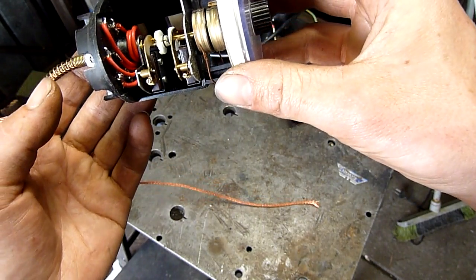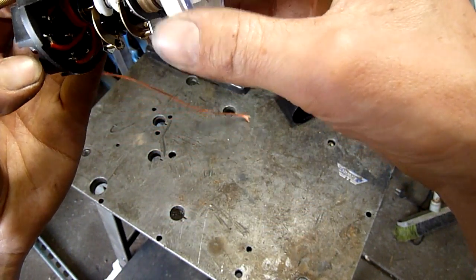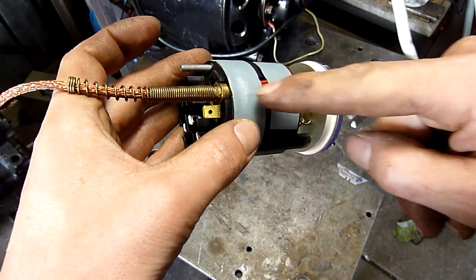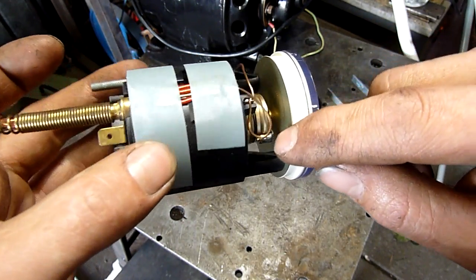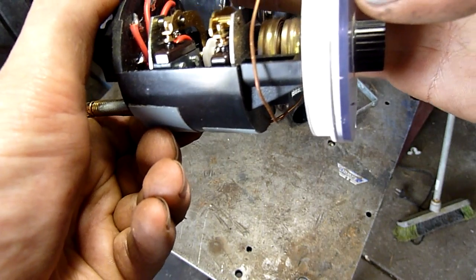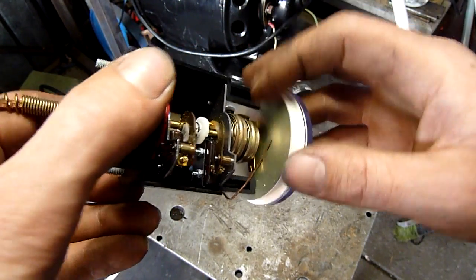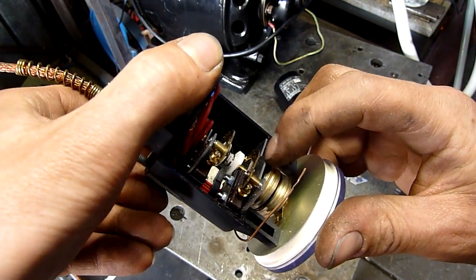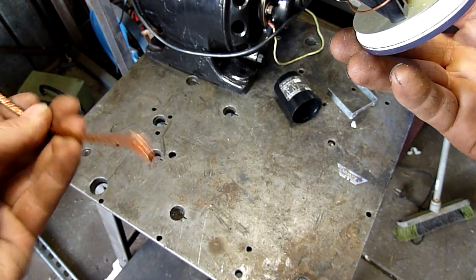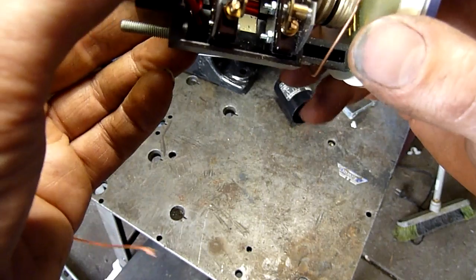Okay, so how is it hooked up? As you can see, that line goes in through here and into one of these coils. The other end is probably the charging point where they fill it and then seal it. These coils here need a certain amount of pressure inside them relative to whatever temperature the sensing bulb's at. So trying to recharge it and reconfigure it at home is kind of futile.